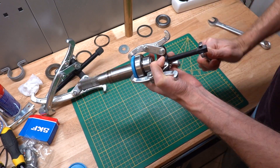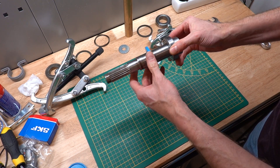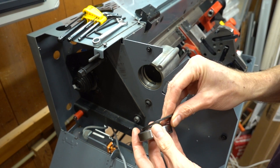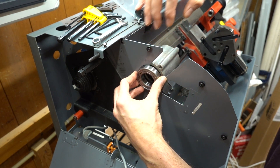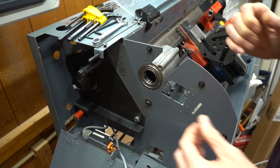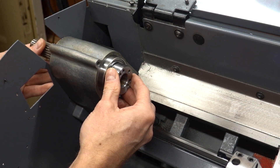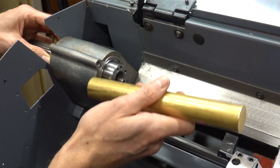To make the process easier, you could also place the spindle into the freezer for a while before starting. When placing the new rear bearing into the headstock, I found that it actually had a sliding fit. This makes sense with the way the preload is applied with the spring washer, but still I had not expected this. I gently tapped in the spindle with the brass piece of stock material, making sure only to hit the outer race of the bearing this time, since that was the part that needed to be pressed into the headstock. As mentioned, some of what I'm doing might be a bit odd, but it did get me to the end goal and as far as I can tell the new bearing survived the procedure.